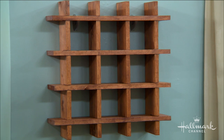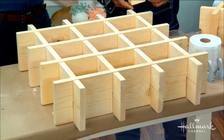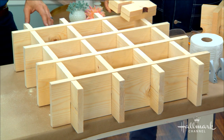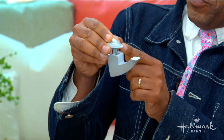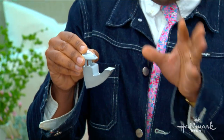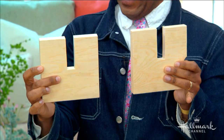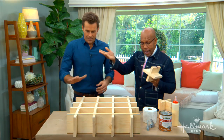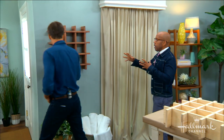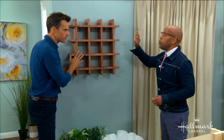How fantastic is this — so much fun! It's a great project if you're a beginner carpenter, a good way to test your skills. To hang it, I'm using the same brackets from the airplane shelf project — these little ones totally disappear, they're adjustable at three-quarters inch, and you just slide the wood right in. For the X pieces, they're four inches to fit into the five-inch shelf, two notches, slide them in on the diagonal. Then hang it, stain it, paint it to match your bathroom cabinet. If you cut them right you don't even need glue, but glue can fix any mistakes.